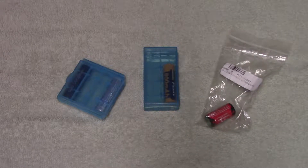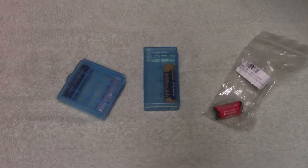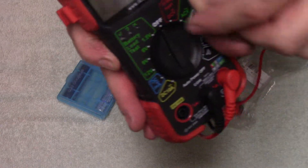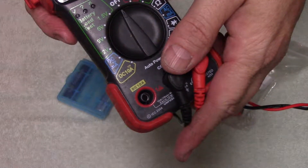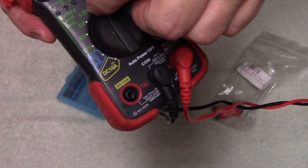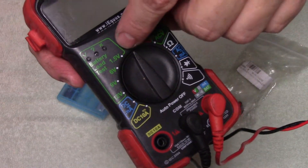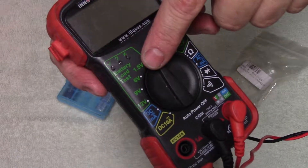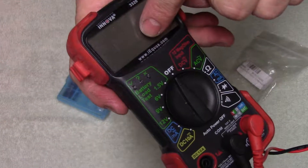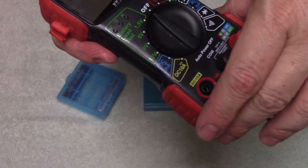There were probably a couple of days where it didn't hit a hundred, but that would have been because of rain or something. I don't have a regular battery tester, but what I do have is a multimeter with a battery test function. There's no 3.7-volt setting to accurately test lithium-ion batteries like 14500s, but the other settings will still work — I just want to read out the actual volts left in the battery.